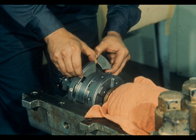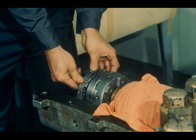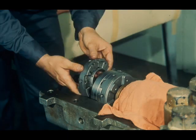Remove the shoes which are on top. Then rotate the base ring to present more shoes for removal. Continue this until all of the shoes have been removed from this side of the thrust collar. Once all of the thrust shoes are removed, the two halves of the base ring are easily removed by rotating one half to the top, lifting it out, and then rotating the other half out.